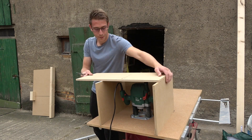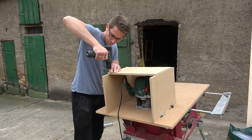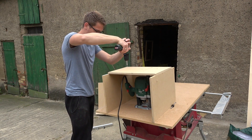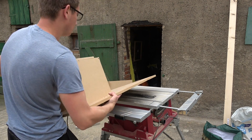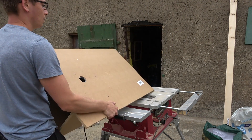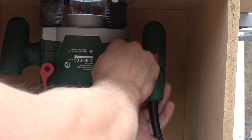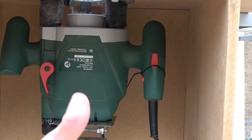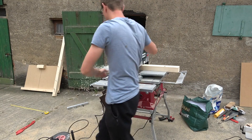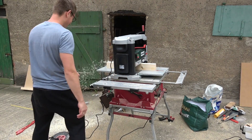Finally attaching the enclosure to the table. I then installed the router again and attached the floor panel to the bottom. Note that the floor panel and router will be quite a few centimeters apart — the reason is the small laboratory lift I'll put between them as a router lift. To control my router I used cable ties to fix the button in place. The last thing to do was to install the special fence: I cut a really square piece of spruce to the width of the router table and beveled it just for aesthetics.